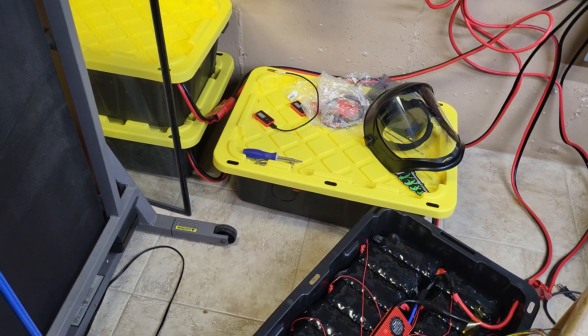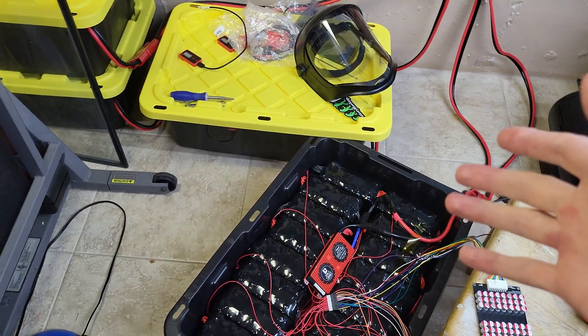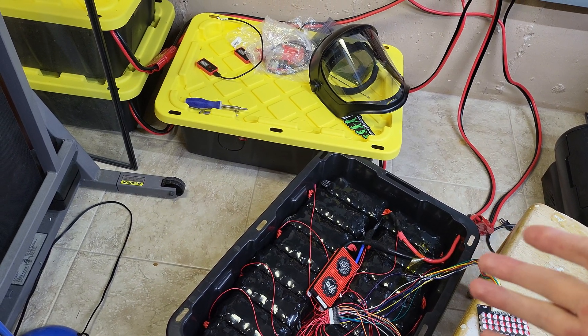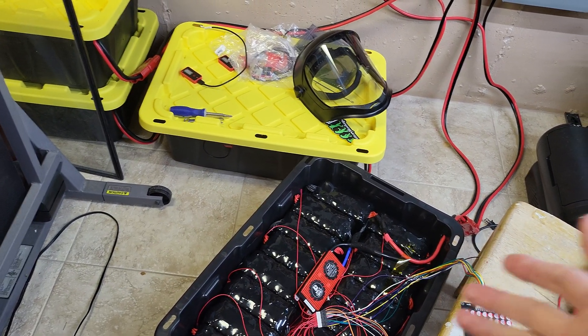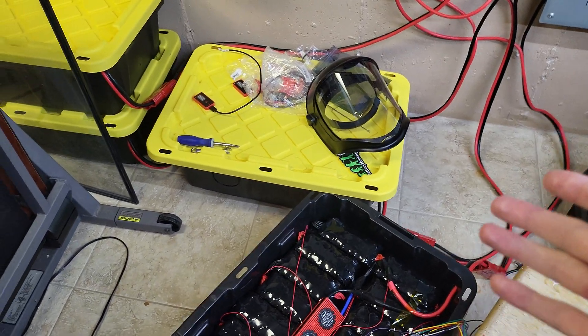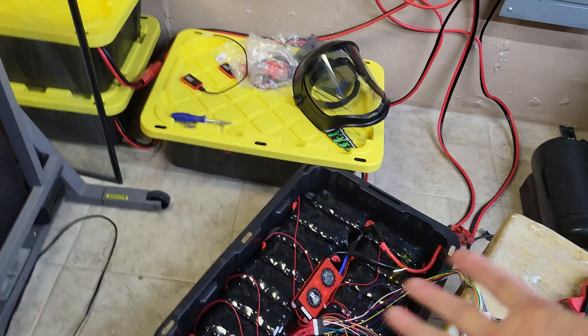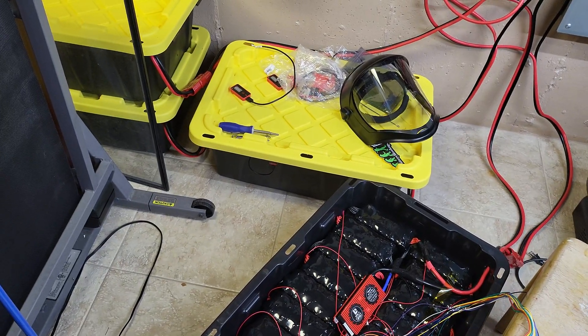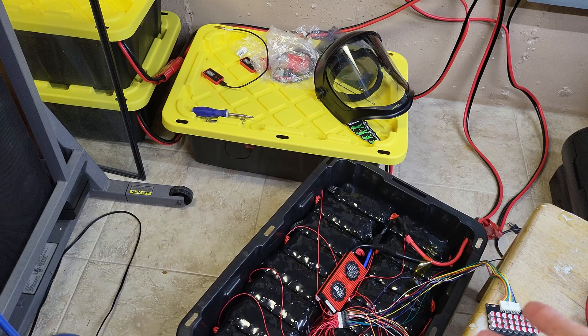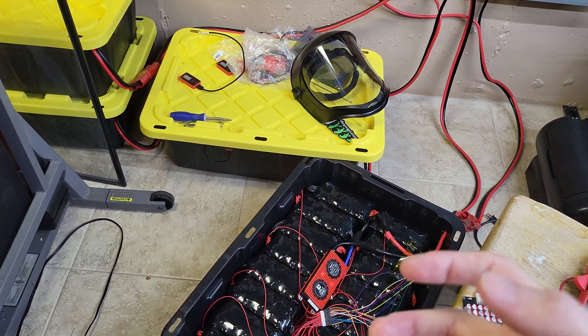I know they should be testing about 5 to 8% over rated capacity, but still I'm getting like 94 to 95% capacity running them from 54.4 down to about 48 or 49 volts. It's hard to really complain about — it's basically all the capacity I'd want to use anyway, so I'm not really seeing any real problem with the small imbalance.